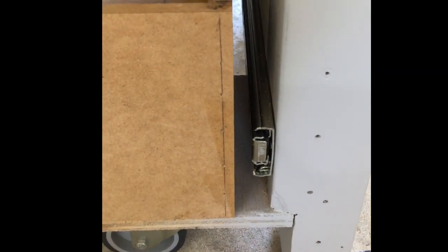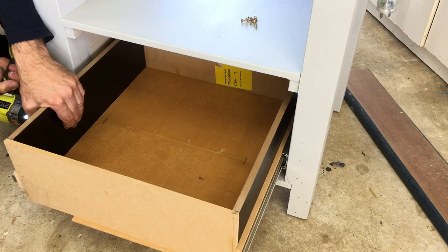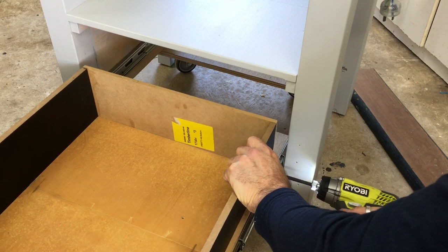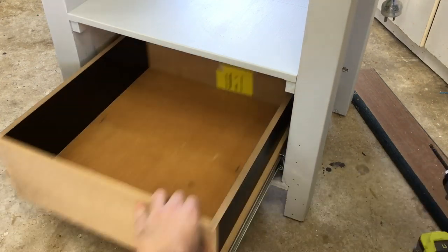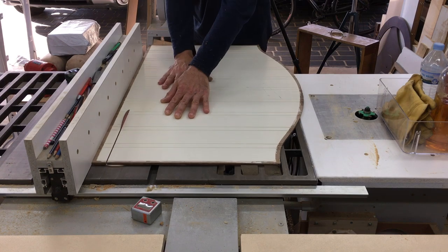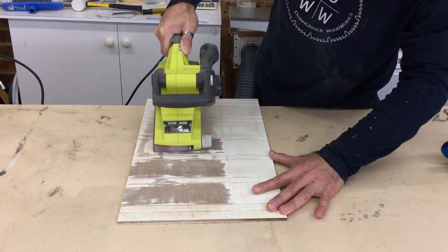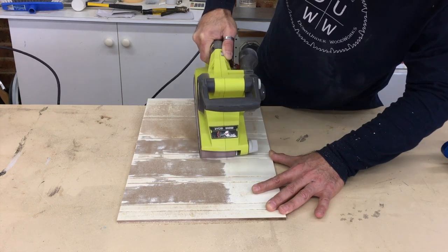I finished the drawer carcass for the flip top stand and went to fit it — but I must have been thinking I was going to fix the front panel onto the side panel, because I was short by exactly two of these. No worries though, I just used two strips of MDF to make up the gap. I used a piece of 6mm ply to space the drawer off the bottom of the cart before screwing on the slides, then used that piece for the back of the drawer compartment. I cut down a piece of v-grooved hardboard from an old bed head for the drawer front, removing some of the paint so I could get a good glue surface to attach it to the front of the drawer box.